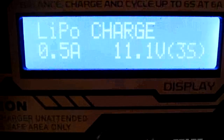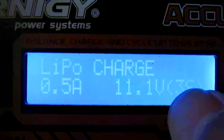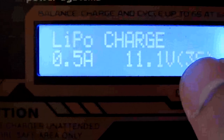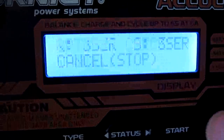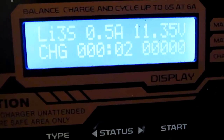If you have 5-cell batteries — most of these are 5 cells — you just have to change the charger to 5S, meaning 5 cells in series, and that should be about 20 volts. But in this case it's 3 cells in series, so 3S at 11 volts. Press and hold Start — it's going to check the batteries. Confirm, press Enter, confirm. And it's charging.